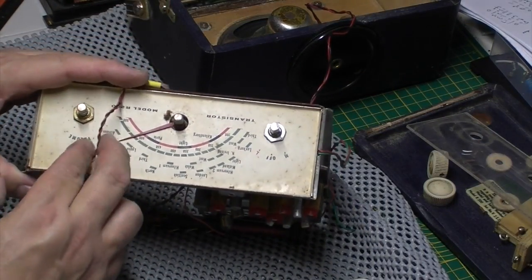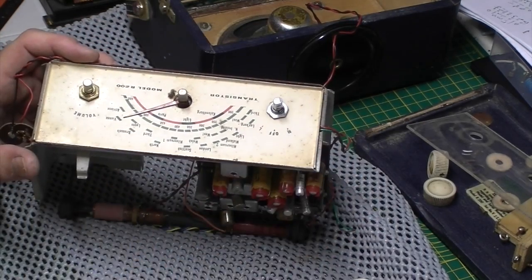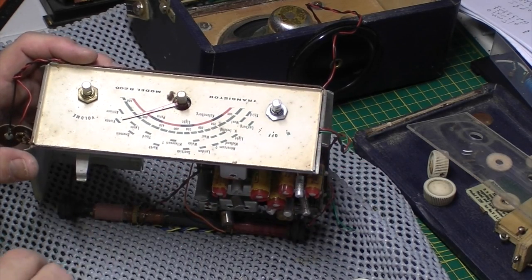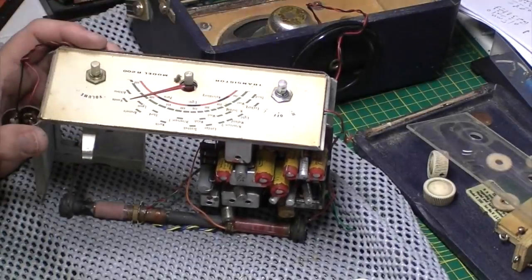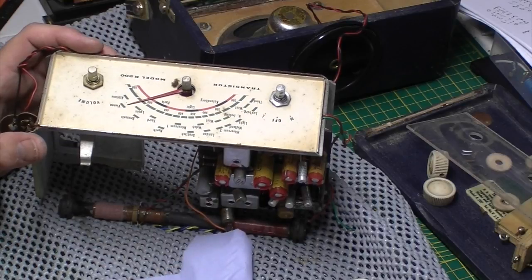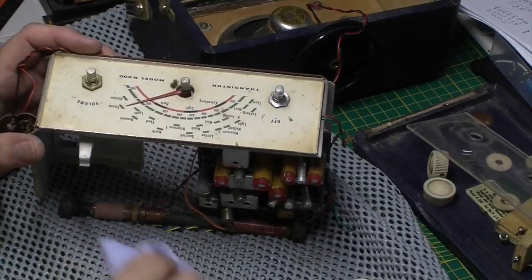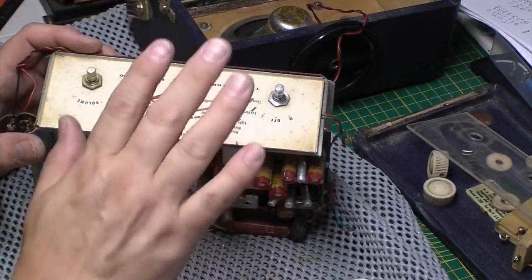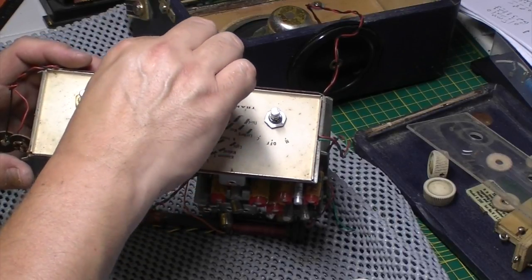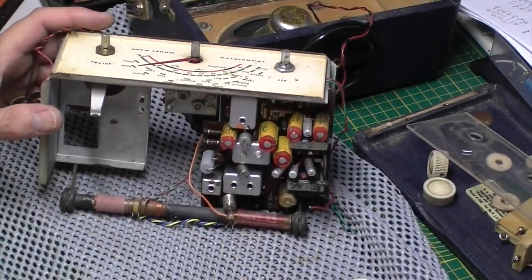And the front panel, trust me, you cannot do anything with that. Just a very light paintbrush, just to brush some of the dust off of it. Anything else you do with it, water will soak into it. Foam cleaner will clean a lot off of it. Literally just leave it be. It looks better, it's more authentic. It's got that antique-y look about it. Don't touch it.